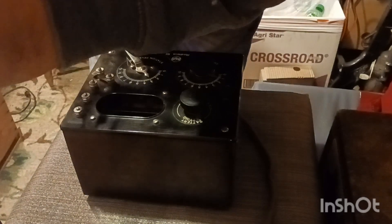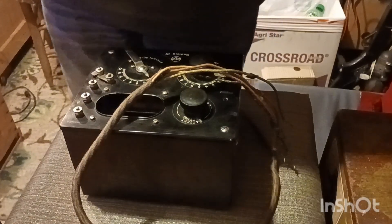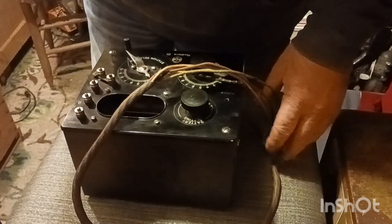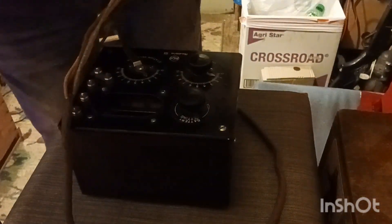I've got a little rust on it - that's the A minus. Then there's the A positive. The A battery is 1.5 volts and is used to heat the filaments. The B battery wires are 90 volts to supply the high voltage on the tube plates. Pretty much straightforward - once we get some tubes it won't be very hard to fire up.